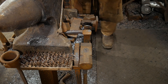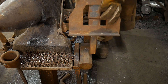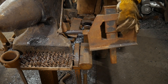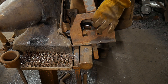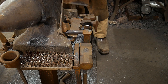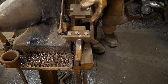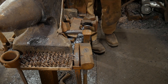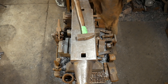On the back side of the anvil it's basically the same setup but holds two different style guillotine tools. One is a narrower tool — plans available on my website blacksmithpdfs.com — for narrower butchering and fullering operations. The other guillotine tool is more robust, for heavier dies. Most of the dies I have are for that larger one; I haven't yet made dies for the smaller 3/8 guillotine.